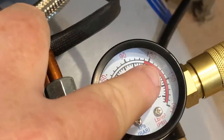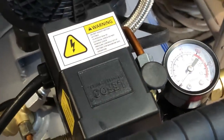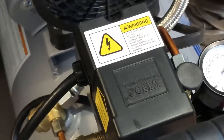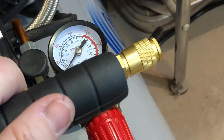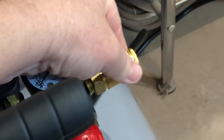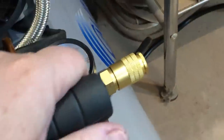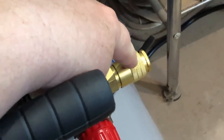It does have a warning indicator. My warning indicator in the red here is at 120. Looks like it's got a max pressure of 180. My hose that I got — unfortunately and fortunately — I got a hose that was three-eighths. This comes with a quarter-inch, and this is the speed coupler. Through talking to Gerald, I realized this is a speed coupler and this is for just proper air tools. So I need a converter because my airbrush runs an eighth inch, not the quarter inch.